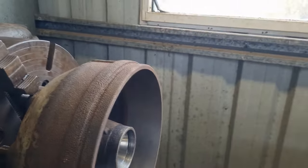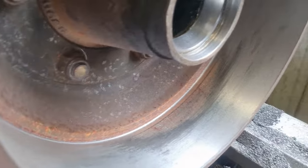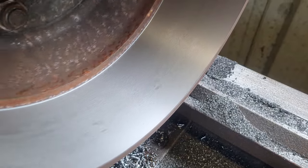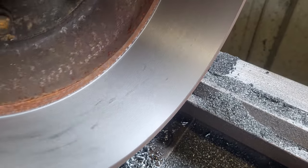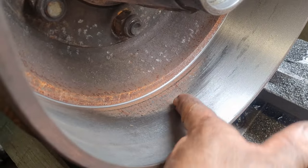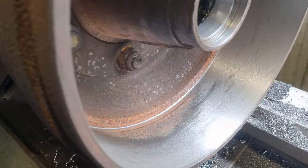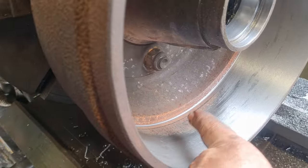So it's lunchtime and I'm starving. I've just taken the first cut and there's just that tiny bit that I kind of missed. Everything I've cleaned up reasonably well. That was a 0.1mm cut. I'm thinking another 0.05mm cut and that'll finish it, because it's only just missing that tiny bit inside there. After lunch I will reconfirm its squareness and concentricity, and if that's all good then that is just warped in the drum.